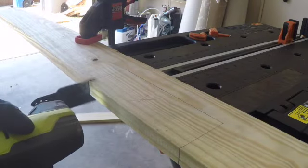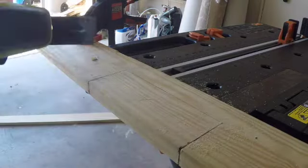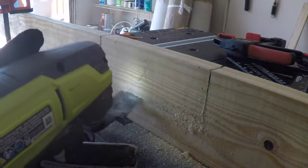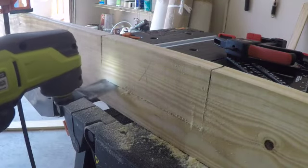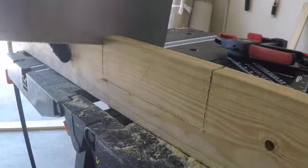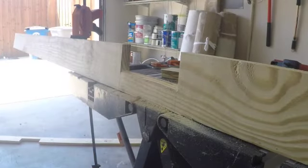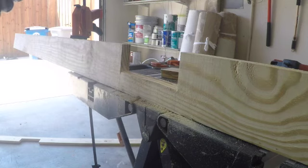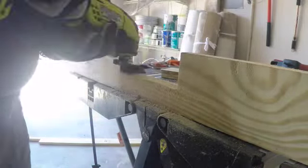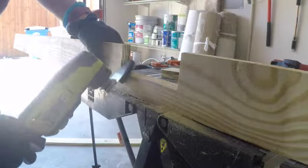Here I'm using a multi oscillating tool and this is a really good tool if you are a DIYer like me because it's very helpful when it comes to cutting wood. Just for time purposes I'm showing you how I cut out a notch from board A - it's the same process as board B. I'm using a saw right here to help loosen it up a little bit more so I can take that notch out. Here I've taken the notch out and this is what it looks like. Then I'm going to sand it down with my oscillating tool. I am sanding this area because this is where I'm going to have my hands when I'm trying to unlock the master lock that I'm going to place over here - that's why I sand the notches.